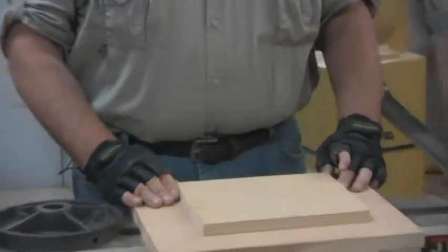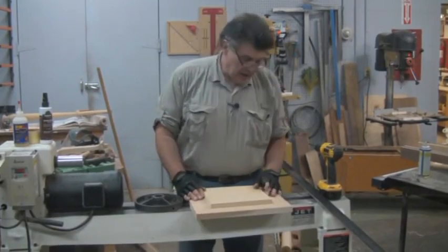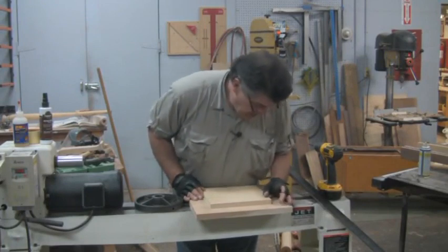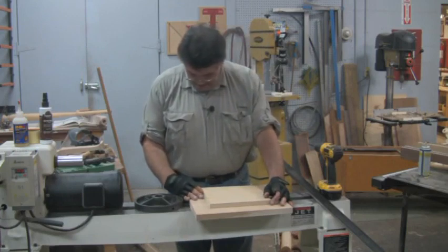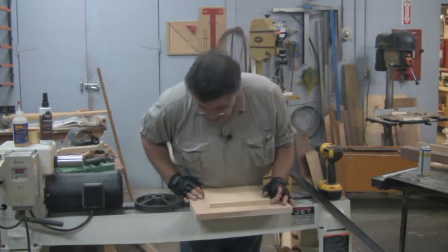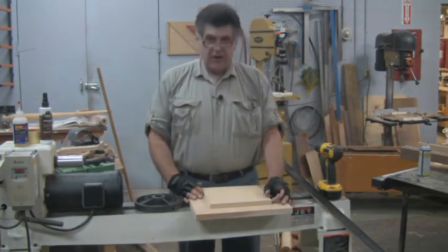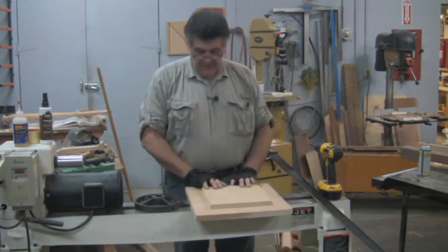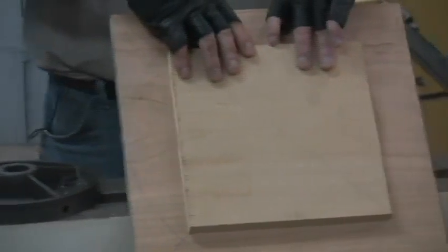Now here's something, and I've mentioned this to you. If you've got it lined out, X'd out, when you line up all of your corners correctly, where everything is matching, you will be dead center. Just the way it works. Probably some formula for that in geometry, but line up your corners with your X marks, and you will have it. That'll give you the center.